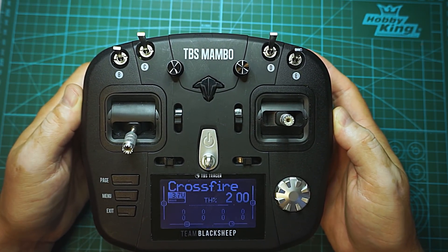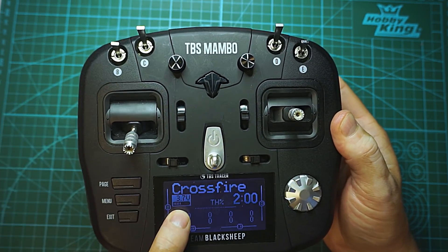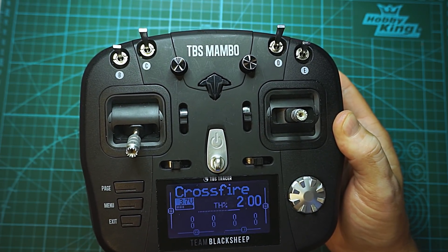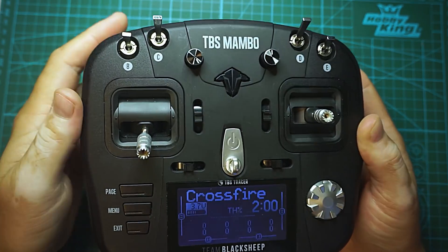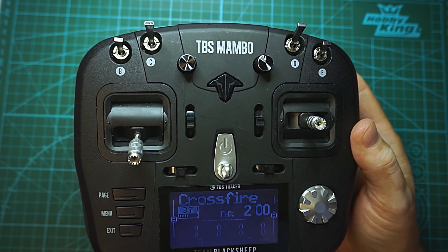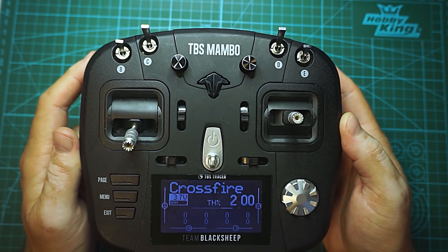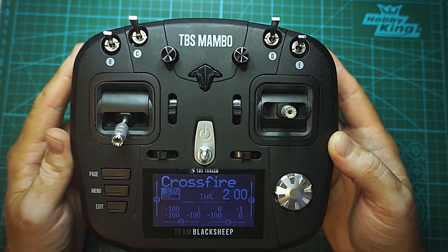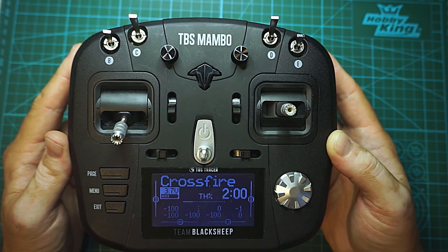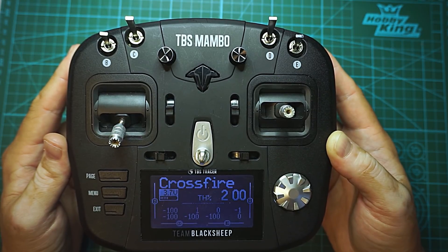This one uses FreedomTX, but I am definitely sure we will see OpenTX on it soon. As you can see, the voltage says 3.7V and that's because it is using a 1-cell voltage to power all the remote. But the trick here is that they are using two 18650s in parallel for more capacity on the battery. I can say that for one week I had no issues running the remote with one charge, using it for long range and normal freestyle. Long range with Crossfire on one watt, so more current draw on that setup.